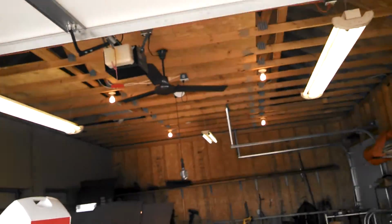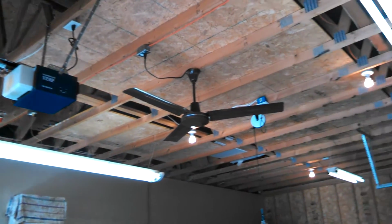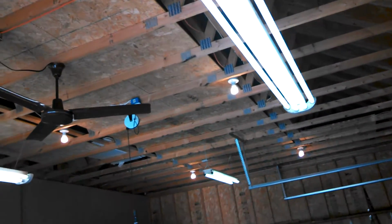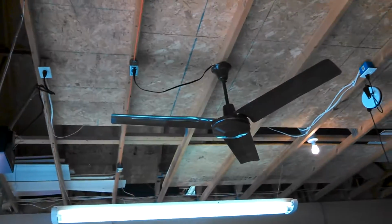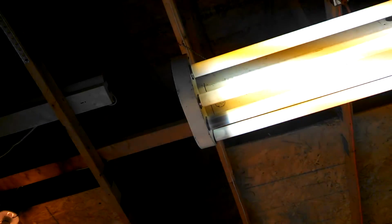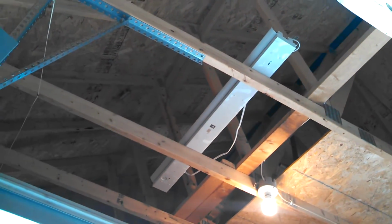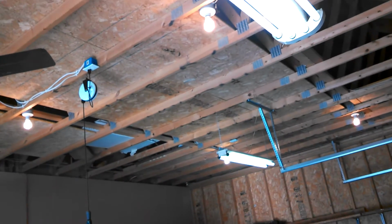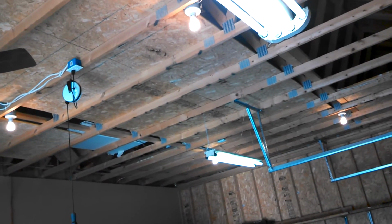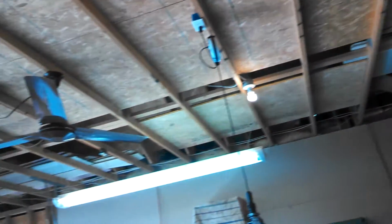So here's the installation once again. And I was really looking forward to doing this, so I'm glad that Chuck said yes. You guys have seen my landlord. He's been in the videos putting Bondo on the SMCs. And he knows a little bit about fixing every kind of thing. That was just the cheap shop light that was hanging up there before. Took it down because it didn't really fit. And you can't put magnetic and electronic ballasts on the same motion sensor without expecting problems. You can do it, but it's not recommended by the manufacturer.